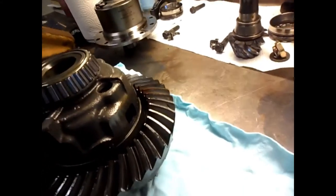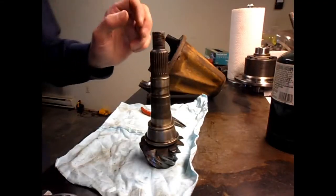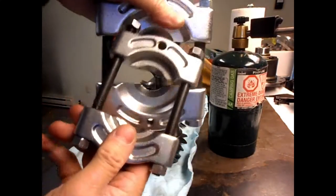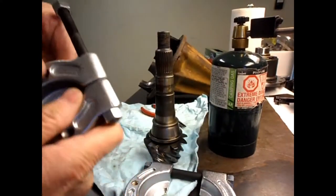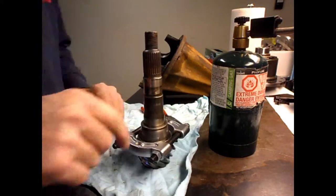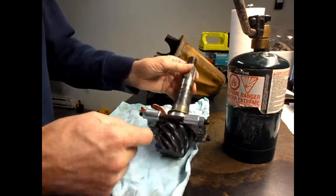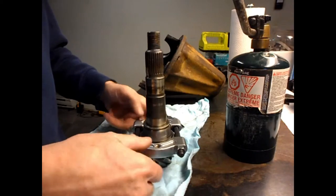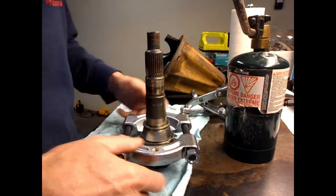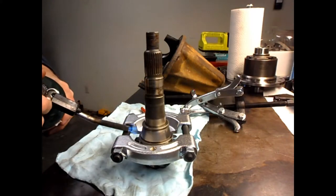While cleaning some stuff up, I found the missing piece — there it is. I took the pullers and ripped off the outer race and all the bearings, then took the torch. I've got two bearing separators — a big one and a little one. I heated up the race that's stuck and got the bearing to move up quite a bit, but I stopped because there's a spacer in there I don't want to damage. Now I'm going to switch to the bigger separator and heat the race up a bit more since it's cooled off.